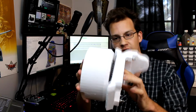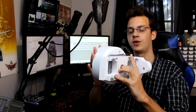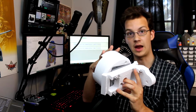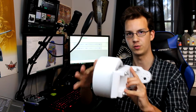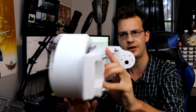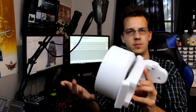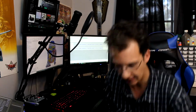And you can probably see what's sandwiched between these two parts is the bearing. So this is going to hold most of the load of the leg, just so that we're not getting any unnecessary stresses on the coupler itself or the body frame. It'll also help create this really smooth motion that you're seeing here. You can look closely, you can see it's fairly easy to rotate this in any orientation I want. So when it comes down to business, it'll be relatively easy to move his legs. And that's about it. So more to come on that guy pretty soon.